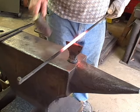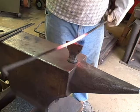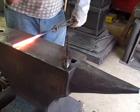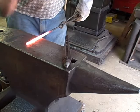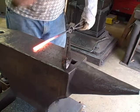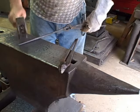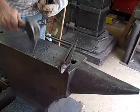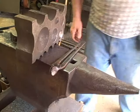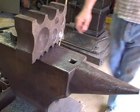The mandrel will be about 14 inches long. I'm going to put a taper on it of about 6 to 8 inches, tapering down to a little less than a quarter of an inch. I'm going to forge a round taper — it has to be straight. When we forge weld with the mandrel in, the object is to forge weld at the taper.